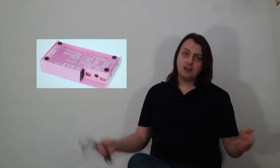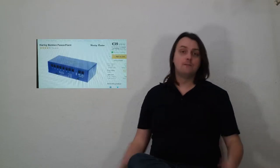The main problem that I had with the original Powerplant is that it was a huge device, pretty heavy, but technically speaking, it's nothing more than a daisy chain in a box. And actually, you can buy the same daisy chain cable and some average 9V power supply, and you get the same results for half the price of the Powerplant. But actually, if you want to get good results, you should avoid the daisy chains, because this way you don't get into ground loops. And if you don't know what ground loops are, you'd better check the original Powerplant video that I made a couple of months ago. It's either in the link in the description below or should pop up somewhere here.